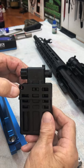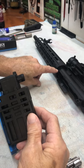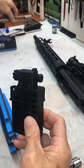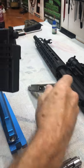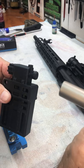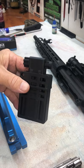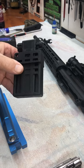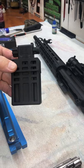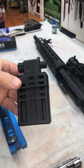It has a pin here that locks into the front locking lug, and on the other end it will use your AR-15 bolt carrier group — this is actually backwards — that would lock into that and hold it stationary in the receiver. Very good product. This is about $45. I've used it quite a few times and it's worked perfectly for what I needed it to do.